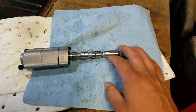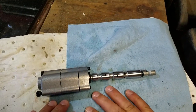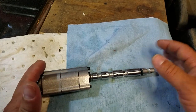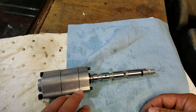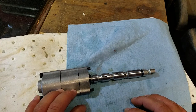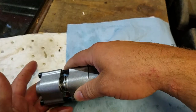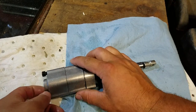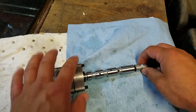They also didn't have an exploded view, pictures, or a video of how to take this apart or put it back together. In lieu of that, they ended up sending a whole new assembly so I could take it apart and see if that fixed the problem — and it has so far worked pretty good. When it would leak, it would fill in the back cap area and hydro-lock it, so I couldn't lower the bucket. You'd have to crack one of the fittings and a bunch of fluid would come out.